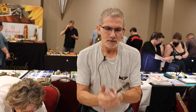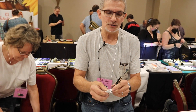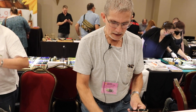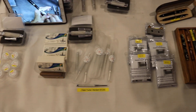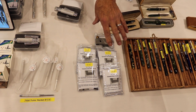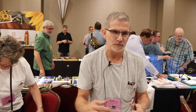Once it comes out, you can release it, take the pen out, and you're ready to do your cleanup. If you're lucky enough and the diaphragm comes out at one time, you can just leave it in the tool, do all your cleanup, put in a new diaphragm, put it back into your pen, and you're off to the races. I also make the pellet pushers with the knurled grip section — this is the deluxe with two different style ends, also for the Parker Vacumatic as well as the standard style. I also make this style vac block, but the problem is it can deform the filling unit on plastic filling units of Parker Vacumatic. This tool does not have that tendency because of the three jaws — there's no opposing force on the sides.